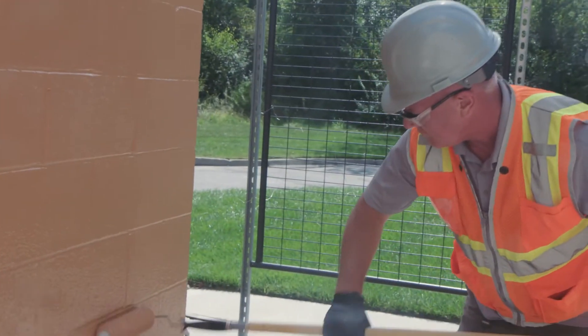For CMU substrate, you'll get about 50 square feet per gallon with this material. With OSB, you'll also get about 50 square feet per gallon in two coats. On gypsum board, it's 80 to 100 square feet per gallon and you can likely do that in one coat application. All the information covered in this video can be found in our data sheet, including how to clean your pump, coverage rates, and the pump specifications we recommended.